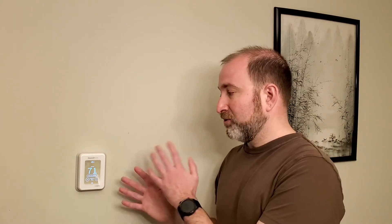I can also do geolocation, though it's something I have no interest in using. I just want to set it on a schedule. With the Nest, I hated the smart auto-adjusting feature — I prefer just setting the times for setbacks and when not to. There are quite a few little features I like about this. It was a bit more complex to set up, and I did have to look up a few things. I customized a couple of settings, like not wanting my heat strip to automatically come on when there's too large a difference between the current and set temperature.